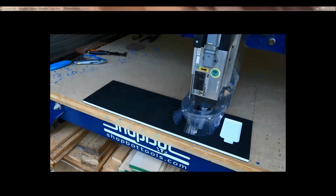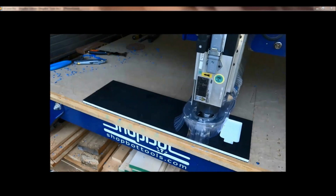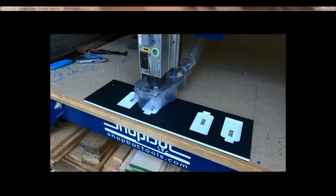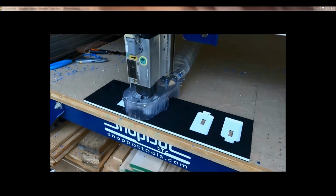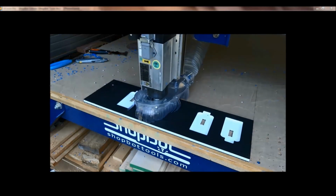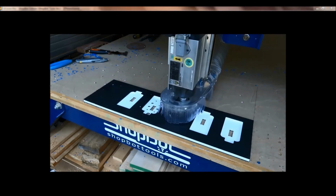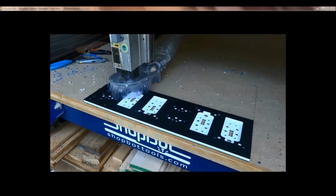And pay attention to the order of operations. When you're getting here into CNC, there's certain cuts that you want to do first. And next it's doing the through pocket, which will be for the mortise and tenon joint. And now here's those 200 holes that it's starting to do. And if you look at this file in the toolpath section, look at how I did the ramps on the inside profile for these. It uses a spiral ramp. So take a look at that. It's very, very beneficial for when you're doing drilling operations.